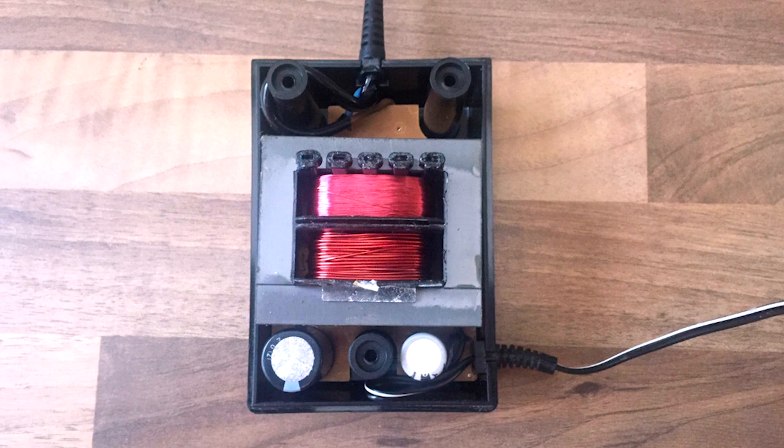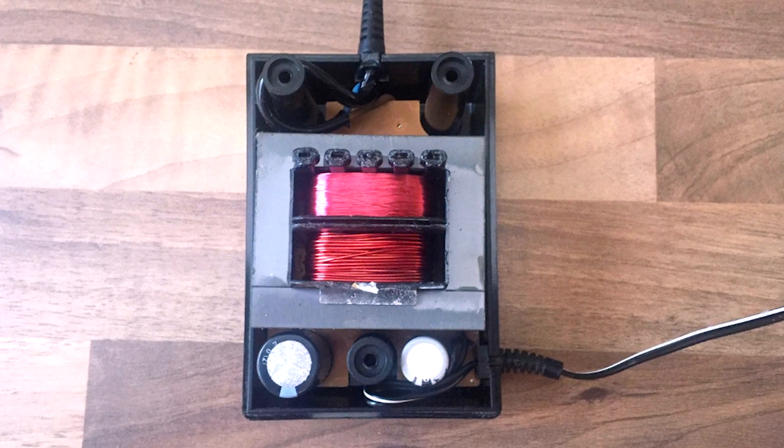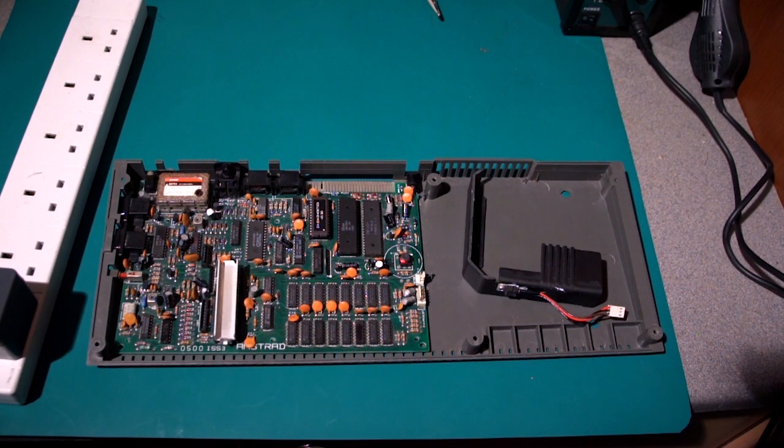They are effectively great big lumps of metal. They're linear. They're supposed to put out 9 volts, but actually if you measure them without any load on them, it can be 14 volts sometimes. And the power should drop down once it's got a load on it. But these things are 30 years old now, and they're electronically very simple, but there's not a lot to them, and the wiring inside them isn't very nice. I don't have one here anymore. I did have one. I threw it away. I just didn't trust it. Even if I'd replaced the capacitors and things inside it, it's not a good design.